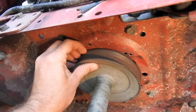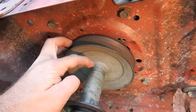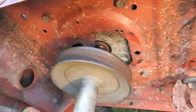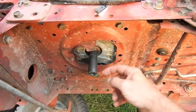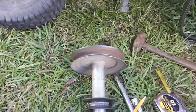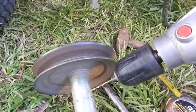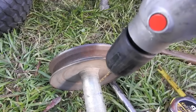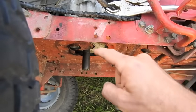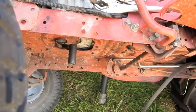Maybe down slightly — that's where I want it. So now I'm gonna drill a hole right about here. I'll measure the crankshaft first and mark a spot — I need to be up into the crankshaft meat, I don't want to miss it. When I measure the crankshaft it sticks down about three inches. On the pulley I've measured about two and a half inches in. I'll drill as close as I can get to the pulley without the chuck rubbing. The only real dilemma is the frame is in the way, so I'm gonna cut this frame up, bend it, then bend it back down and screw a plate over it to strengthen the frame back up.